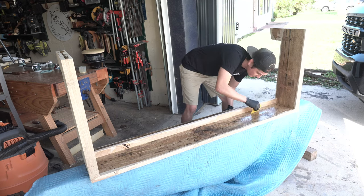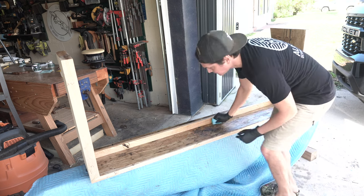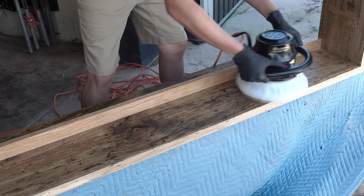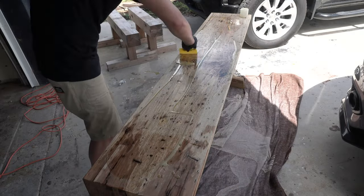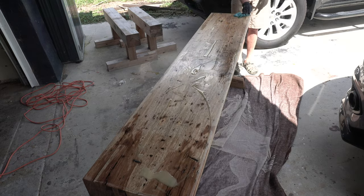I don't necessarily know how accurate that is, but it does tend to make sense as I assume a coarser surface for this product helps with the adhesion properties. Anyhow, Rubio is a great option for a quick and easy finish. It is a wipe-on, sit, and buff-off application, and it's ready to handle within an hour or so as opposed to my preferred finish, which is a drying oil such as tung oil, which takes sometimes weeks to fully cure.